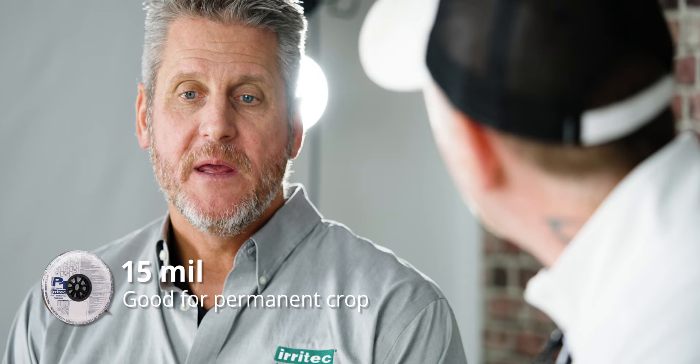The 15 mil tape has two big applications. The first is that 15 mil tape can tend to be a permanent crop tape. If the grower understands his rotation and can put tape in the ground and farm right over the top of it — which really has to do with crop rotation — the guys that want to leave tape in the ground for 10 to 15 years and farm multiple crops over the top of it will find this phenomenal. The 15 mil thickness allows us to handle the wear and tear of farming something over the top of it for 10 years.